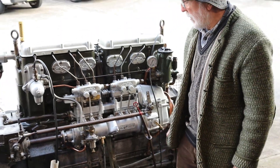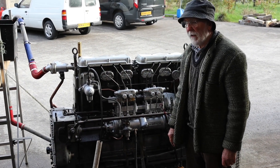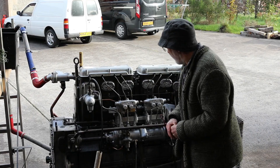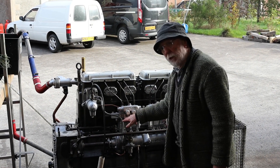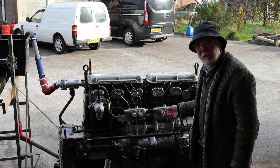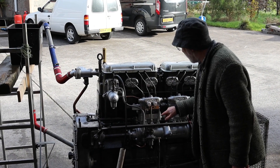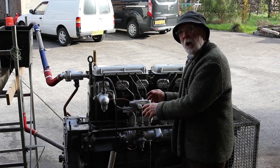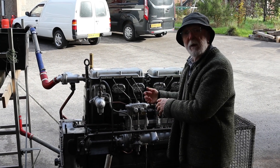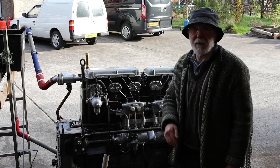What I'm trying to get across is that we can latch down each one of these latching levers in turn and actually tell how much power each cylinder is producing. With four latched down, we've only got two cylinders doing any work and those two cylinders have to drag the others around with them. We can establish how much power two contribute, then three, and work out how much each cylinder contributes — perhaps revealing one that's particularly weak. They should all be roughly the same, but one or two may be contributing less than they should.